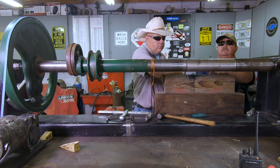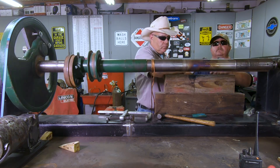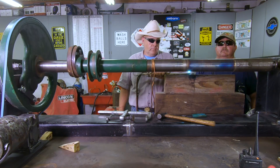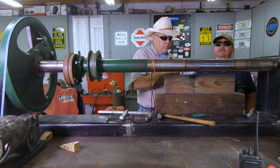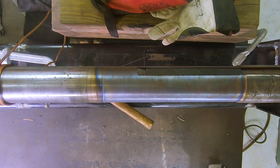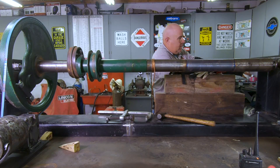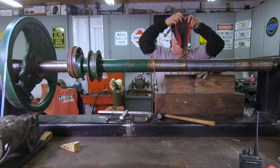We're going to add about 400 to 450 degrees of heat using one of those little infrared heat guns to keep checking it. We might even stop and allow the temperature to normalize down the shaft a little, then heat it again, just to warm the whole thing up. We don't want to put a lot of heat directly on these parts, but if it travels indirectly there's less quench available. We got it up to about 450 degrees — it took a while but we've now started to heat the thermal mass, so the whole thing is getting hot and will retain that heat. Now we're going to quickly tack that key blank in place and then start rotating it and welding it up.